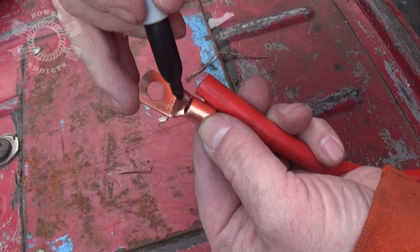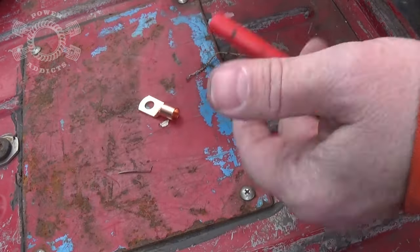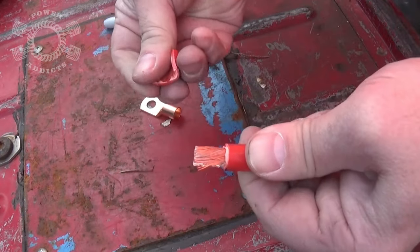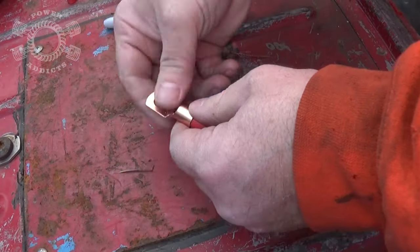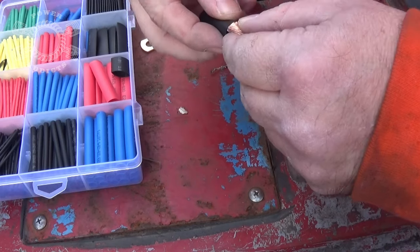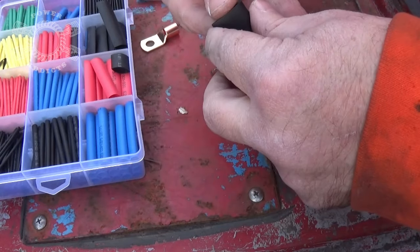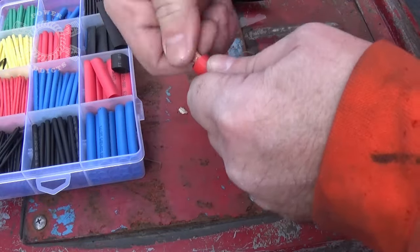To mark your installation, take your lug, butt it up against the edge here, take your marker, and mark right there where you need to cut it — then pull that insulation off to put the lug on. Take your razor knife and score a line around it, score a line straight, split it open, then you can take your insulation and peel it off like that right there. Now let me get my big crimpers. Also heat shrink — can't forget that.